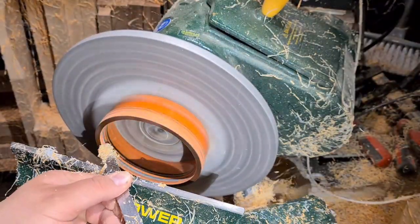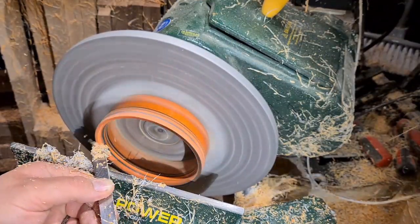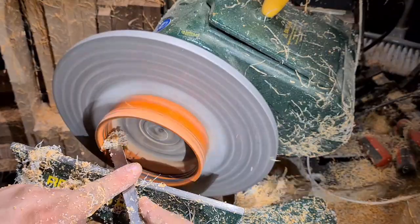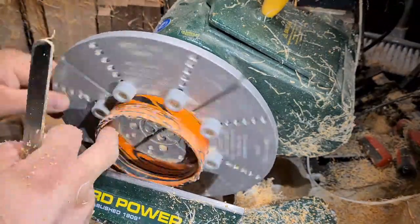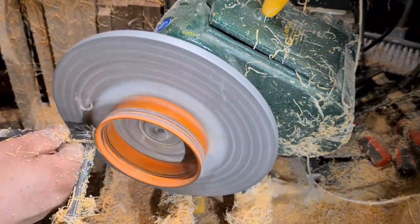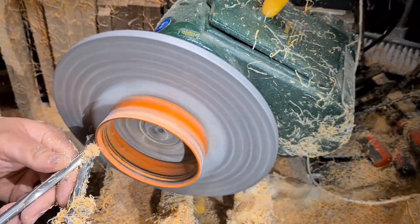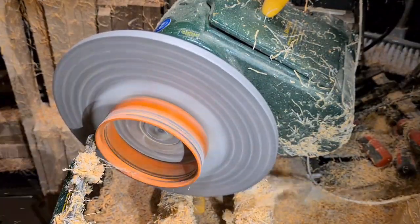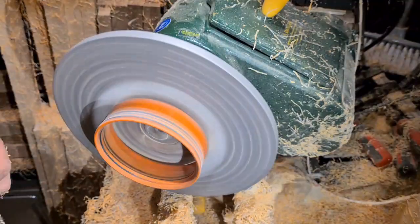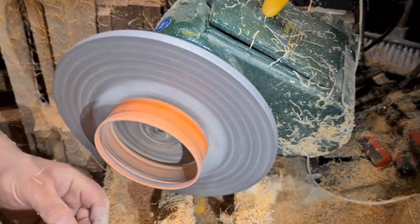Turn it round and then just do the final shaping on the other side of the ring. I think I'm going to class this one as more of an anklet — it's a little bit big to be a bracelet. See the final shaping on the outside there. And final touches with the gouge — I think this is the only one I used the gouge on, really. It was just because I did a little convex shape in the width of it, which you can't really get the scraper in so close to the rubber jaws.